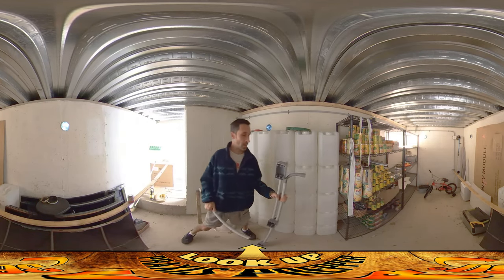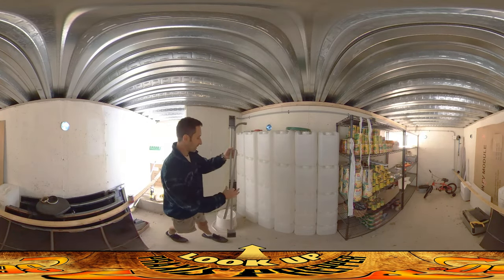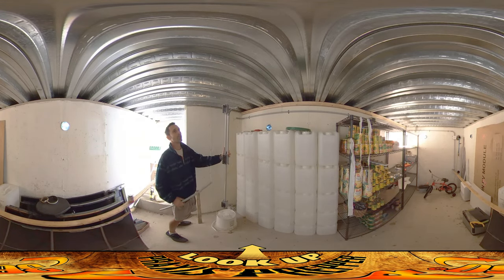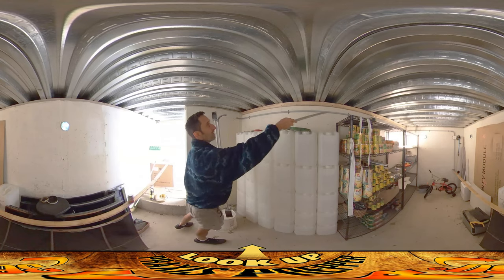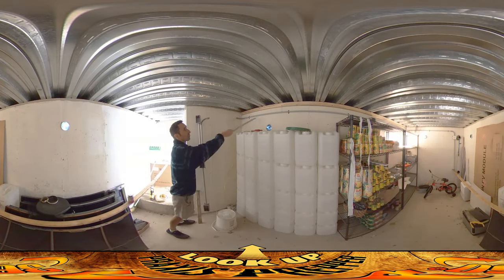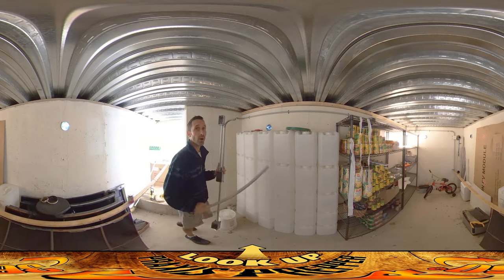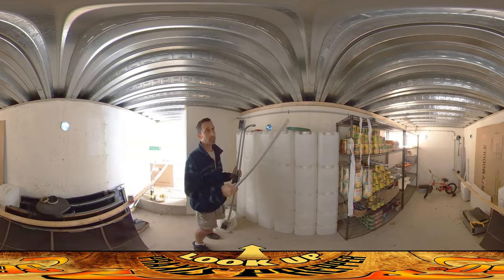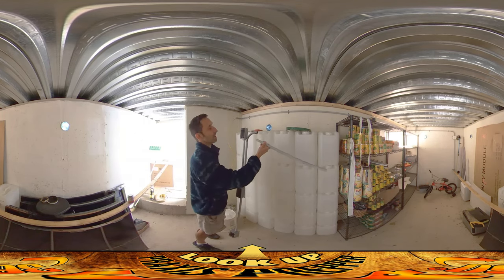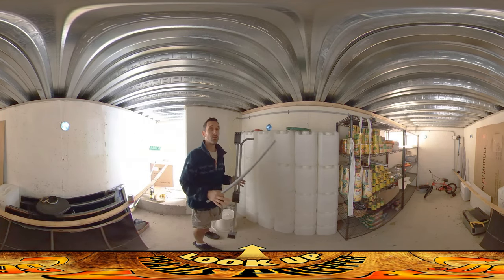The new wire has come in, but in the meantime I was working on other things. I created some of the conduit pieces — especially this one is a little bit more on the complex side. I was able to get this conduit piece in here this morning and just ran this piece of Romex through it. It's really important if you're going to be pre-setting up a conduit and plan on putting Romex through it that you make sure you don't have too many bends in it.